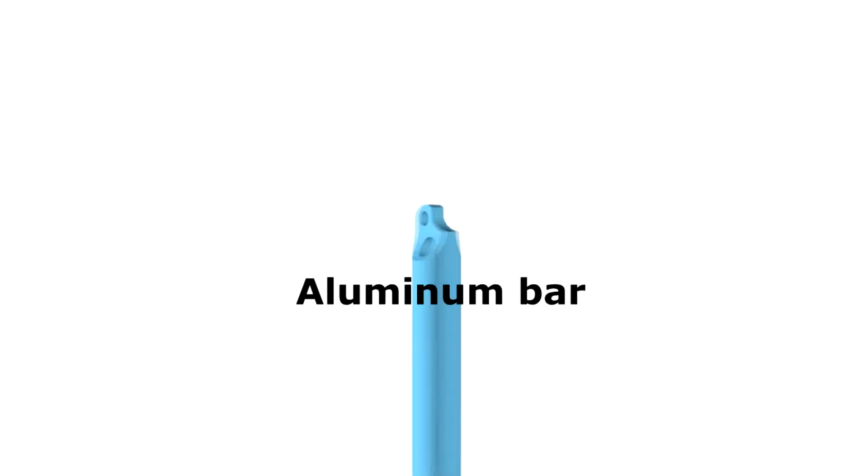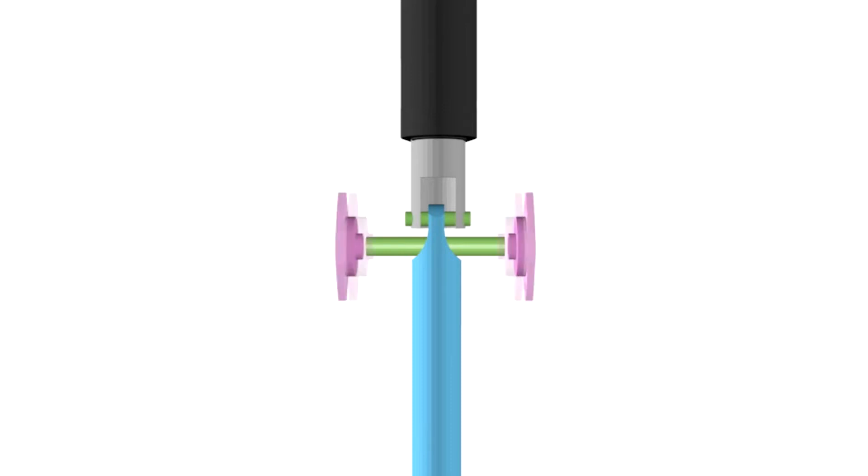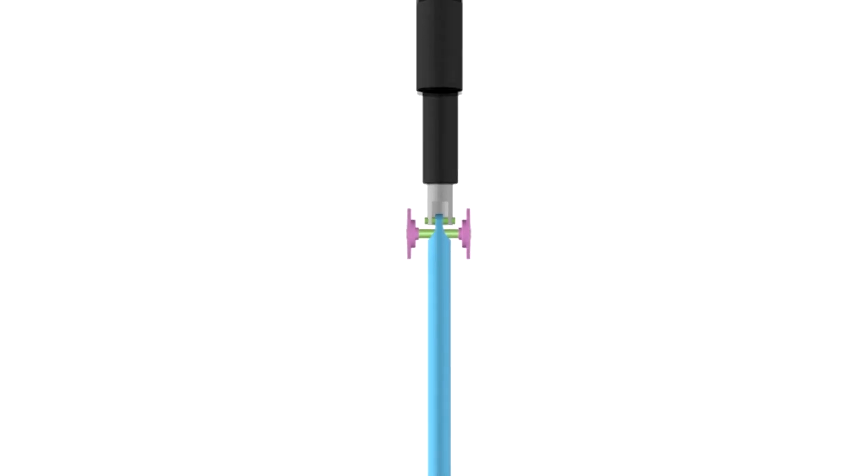I made this animation to show how to build each paw. This is an aluminum bar which forms the lower bone of the paw. The linear actuator rotates the aluminum bar as a lever machine. The green cylinders are rotational axes, and the elbow axis has attached two bearings, shown in pink color.